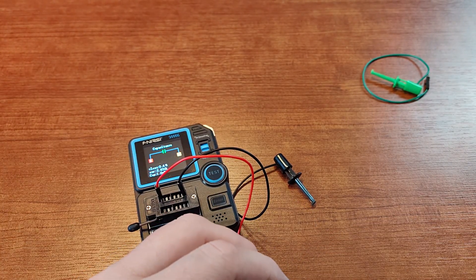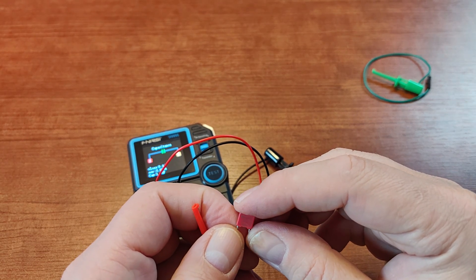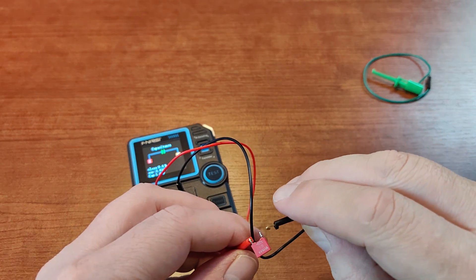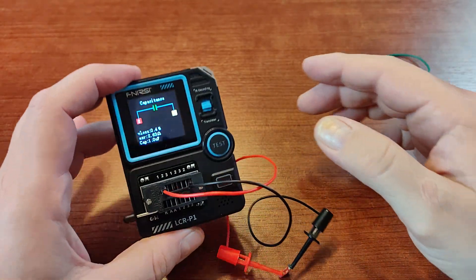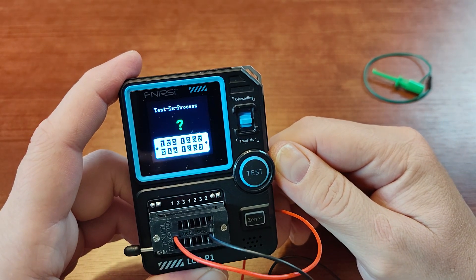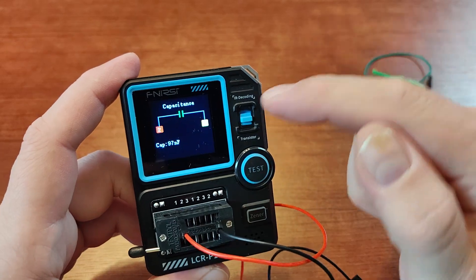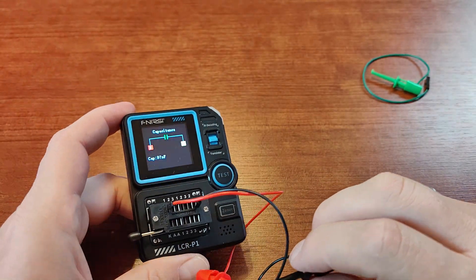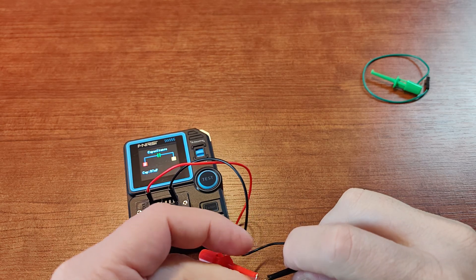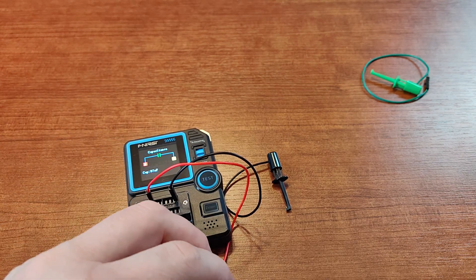I have another one. This one was removed from one of my smaller digital-to-analog converters — I was replacing it with something else. Let's connect this one and test it. We will learn that this Wima capacitor is in fact 97 nanofarads, which is useful information because it should be 100. So if you need to pair capacitors, resistors, or anything else, this is quite a handy device.